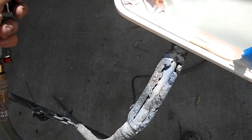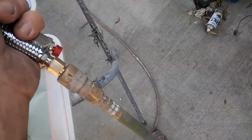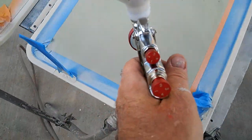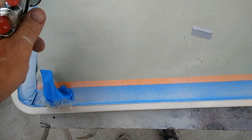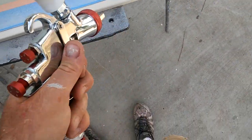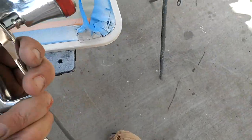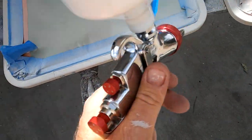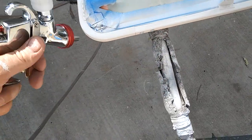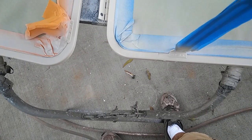Almost no smell. It's under the limit for volume, so you can do this anywhere you want, pretty much. I'd probably put a 2-ounce pot on it next time. Just kind of testing it out right now. This is probably half the volume of an LVLP. I don't think an LVLP gun would spray at this low of an air flow. Almost no airflow coming through, no cloud. Almost 99% of the paint's going on, so that's super efficient transfer.